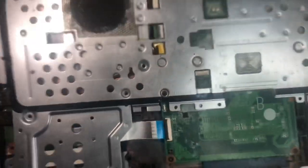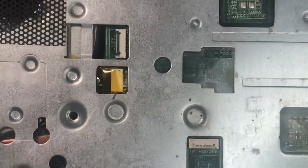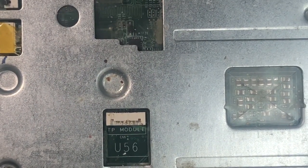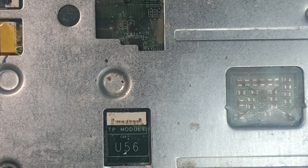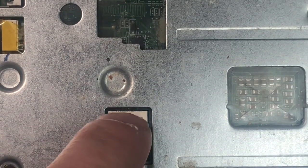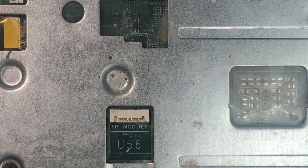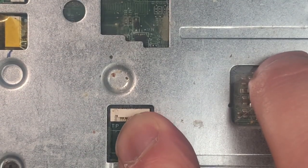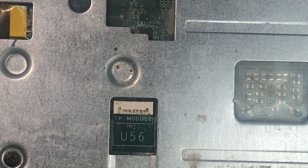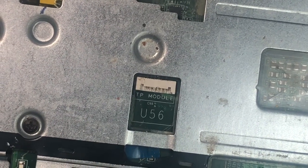I'll show you what I mean — we'll zoom in. See how this has a clip here? Well, that one got damaged in transit. It no longer has a clip and the pin is missing and broke. So what we're going to have to do is heat this up and put a new one down. This is a six-pin connector — one, two, three, four, five, six — yep, six-pin connector. I believe that's one millimeter spacing, could be half — we will find out.